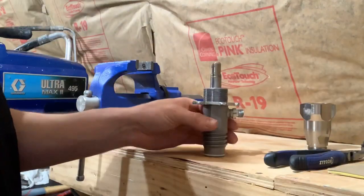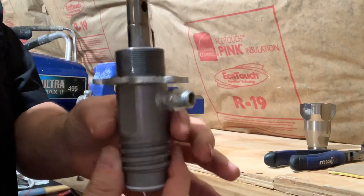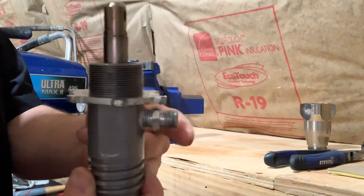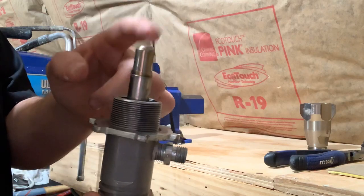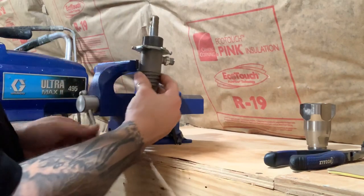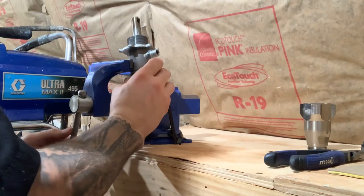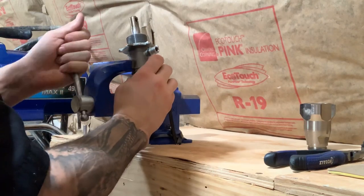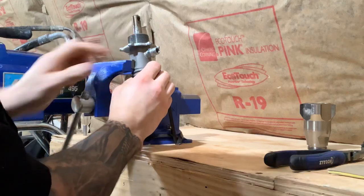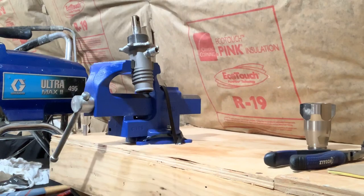Here is what your pump assembly will look like — it connects in the back to the sprayer. This is your actual piston. We're going to put this guy in a vice, which is very critical in this situation, because without a vice you cannot get the amount of force needed — you can't hold it with your bare hand the way a vice would.